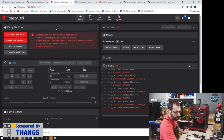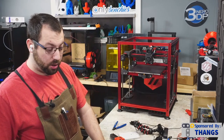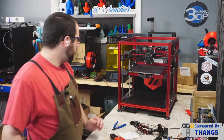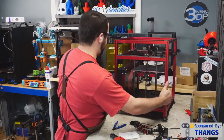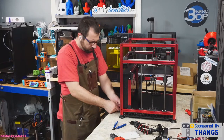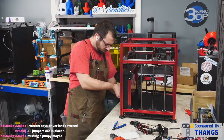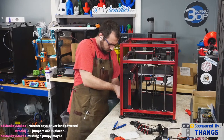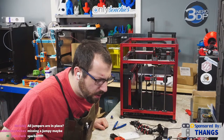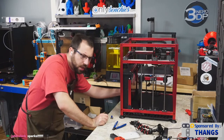So let me go dig in here. Let me go digging. Do I not have the jumpers in the right spot on the board? That might be an issue. Let me turn the printer off. Pull a stepper and see what we got. Oh, just in case. Paranoid. Okay, so I need one jumper by the 100. Yeah, one jumper, and it's next to the 100. Yeah, okay, so that's right.